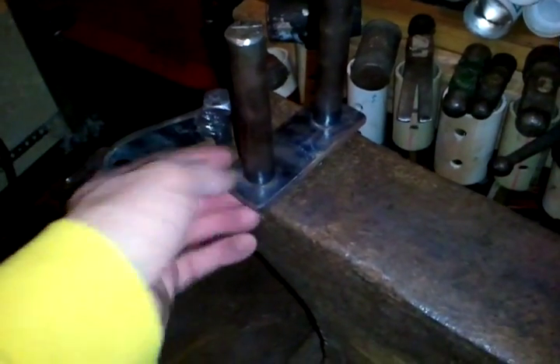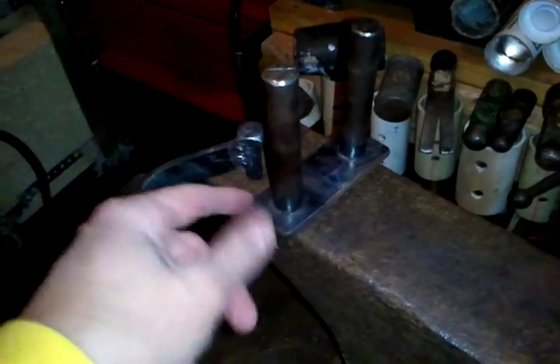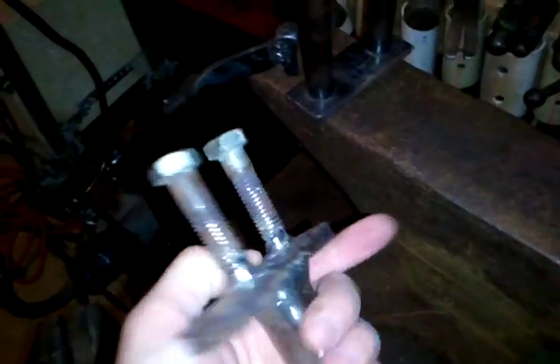The pins — I drilled out the plate here, a nice big hole about as big as my finger. Then turned it upside down and welded through the bottom into the pin so that there's a nice flat surface here and a round surface here to work with. Just a little hardy tool. I made another one the other day with bolts, but the threads on the bolts aren't as nice as this one. It's still usable I guess.